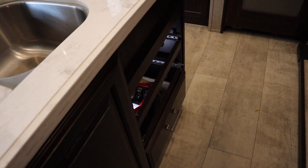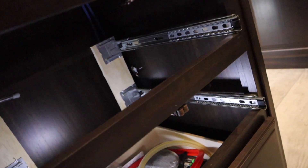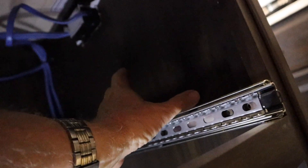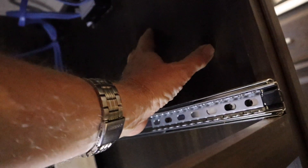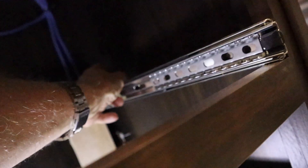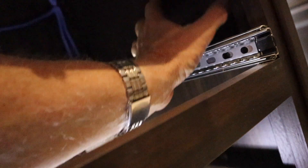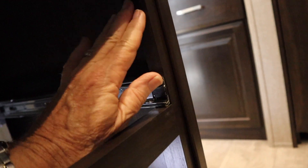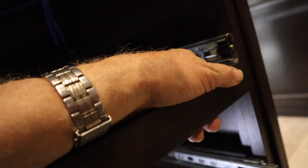We've already got a couple of drawers pulled out and I have one of our lanterns in here because it's dark — for some reason they don't put light bulbs underneath your cabinets. Back here is where the backing plate is going to go. Measuring from this corner brace to the one down there, it's about seventeen and a half inches, so we're going to cut a piece of one-by-eight material to fit right in here. We're going to put corner brackets on this side and on each upright, and also glue it, which should give us a nice firm backing for the drop leaf brackets.